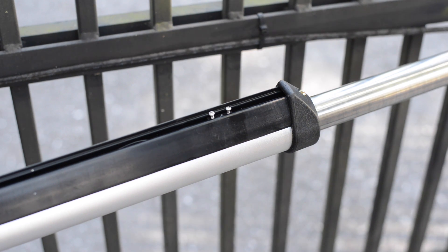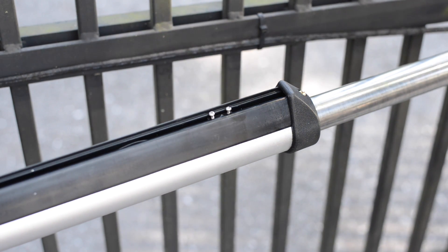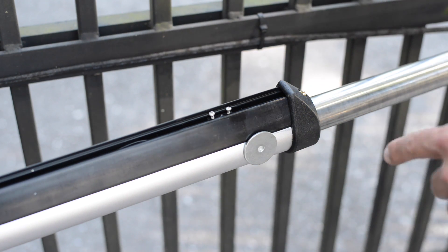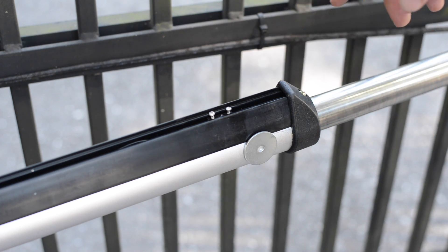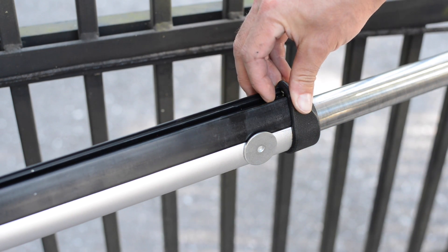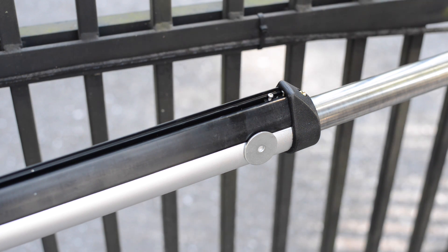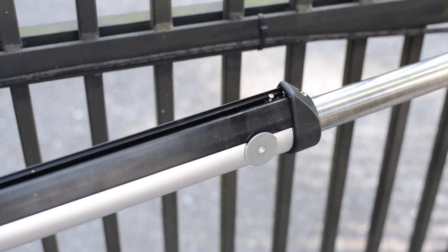This is the second troubleshooting tip. I have turned the piston so it is all the way out to the end, bottomed out — it can't extend any further. Notice the magnet is not all the way at the end of the arm. Sometimes the limit switch will be adjusted all the way into the end like this. When the gate opener goes to close, it still stops because it has hit the maximum extension of the arm, but is technically not hitting the limit switch because the limit switch is over-adjusted past where the magnet can trigger it. Over time, this will cause the gate opener to malfunction because it is hitting the end of the stroke length rather than stopping on the limit switch.